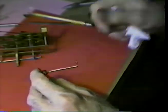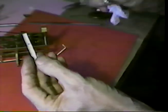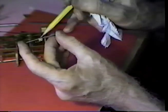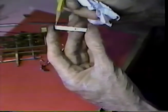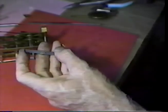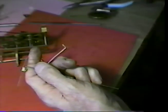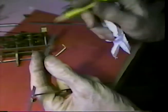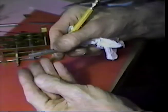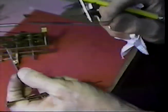However, the ones that have a saddle on them and function on a pin, take for instance, let's look at this right here. This is a verge in making. This is the saddle and the holes in it, and this is the hole for the crutch wire to go in, and this is yet to be formed. I have several such as this here in the shop. Here's another one that is most nearly finished. They have quite a good selection on those. I make these up from time to time. And this is the way that the verge of the saddle type begins. This is what you find in the classic kitchen clock. At another time, we'll show how to produce one of these. This really can be made a little easier than this.